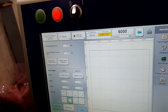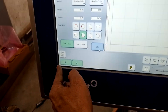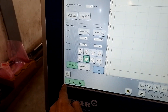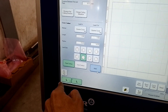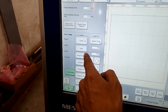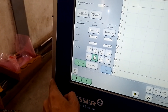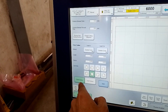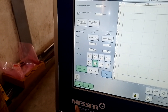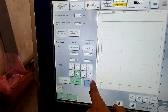This is your plate and you want to cut here — this is the distance plate to part. Next, lead-in and lead-out. Lead-in means if you want to cut here, you will start cutting here — this is lead-in — then cut is complete and it will finish. You have different options: none, straight, 90 degrees — different angles. You can change angle going in or out. Outer means if you have a circle — double circle — outer in and out. Inner means inside you have a circle — inner lead-in.